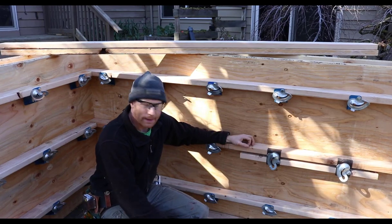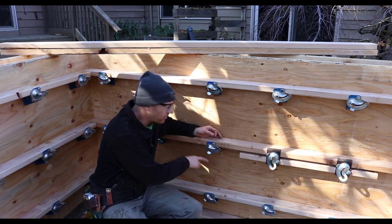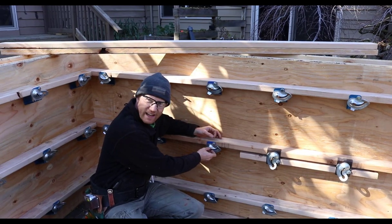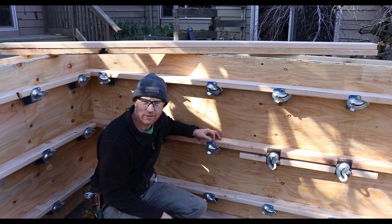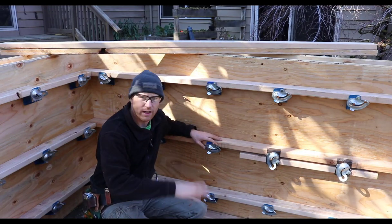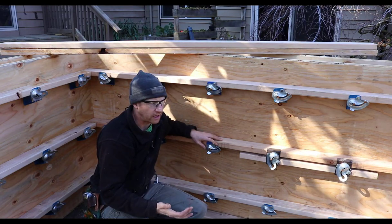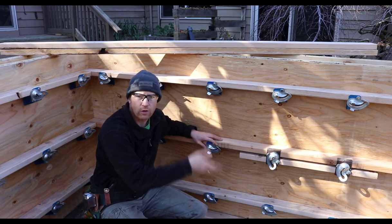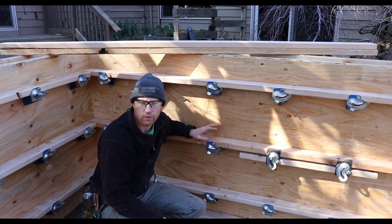They actually make a tie extender that attaches to the regular button head on these snap ties and extends it out so you can use the Jahn C on a strong back row. You only have one type of snap tie. Those ends go on wherever you need them, wherever you decide to need them, and you can reuse them. So you take them off after the placement and reuse them over and over and over again.